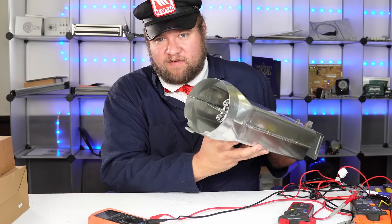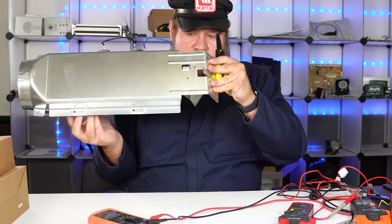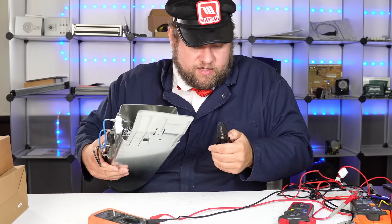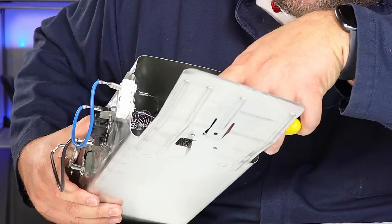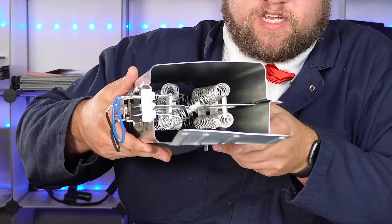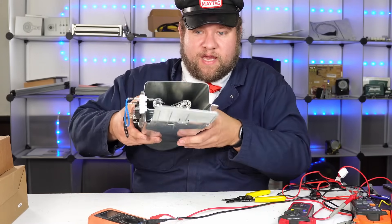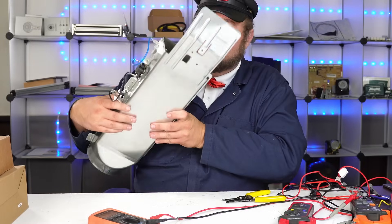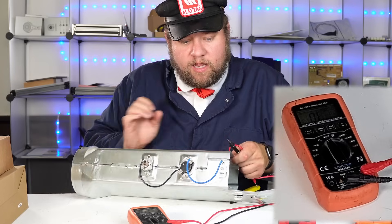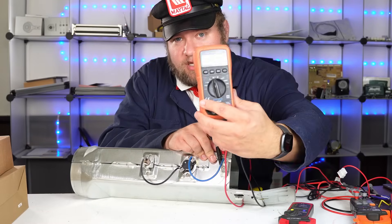Let's remember that I love you guys. We got a signal and some amperage - I'm going to take my wire clippers and rip it from this side. I'm destroying an element on camera and I'm going to cry afterwards. I'm going to clip this wire. So we've broken the internal wire - it is not working anymore. YouTube pays me a fee to do some of these videos so there'll be listings for all these multimeters, and if you need any check out the shopping page. You can see the wire is now totally shot and dislocated - like if something melted. We should get an open line now, and we are of course getting nothing - OL, meaning there's no connection.